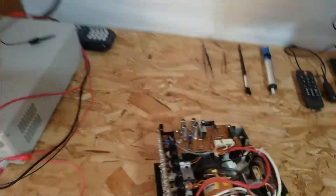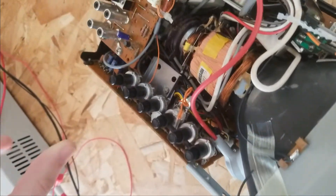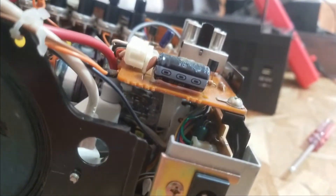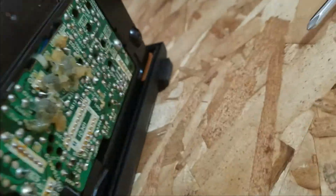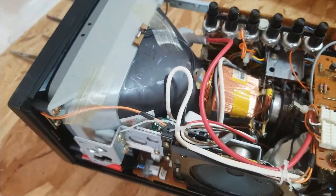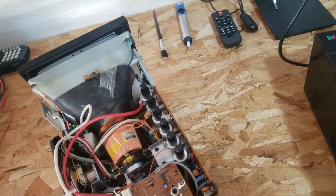Inside we have a quite nice little CRT. The neck board is right here — though it's not actually attached to the neck. The thing plugged into the socket of the CRT is just a small white connector with wires going to this board, then to this board, then to this board — a very compact construction. There's a speaker, and that's the deflection yoke with all the adjustments. This thing just runs off 12 volts and draws about 1 to 1.5 amps.